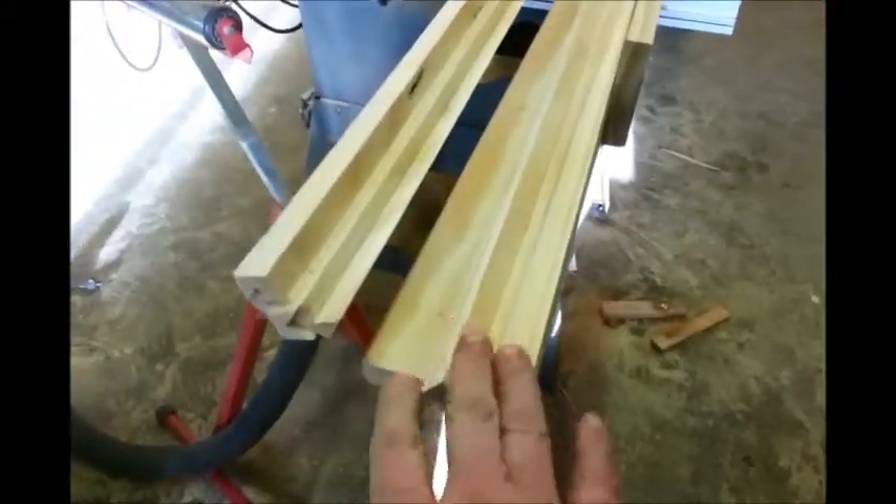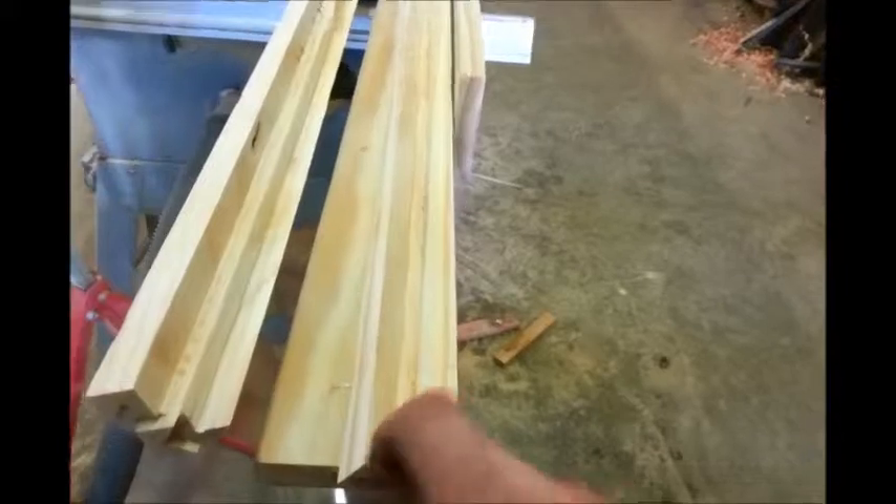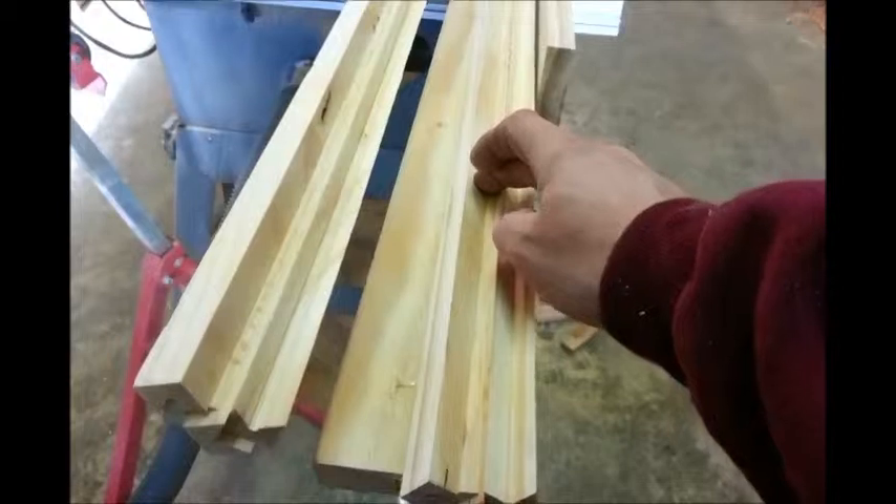We should have one up here at the very tip. We're going to be running several eyes through the tip of the mast to hook our pulleys onto. Unfortunately, when we put this together, it makes a very small opening. So what we're going to do is get this all clamped up without the end stiffener in, then take a large bore bit — a half inch should do it — run it down the center, and then insert a dowel with some urethane glue down the middle.